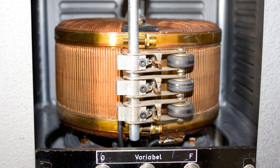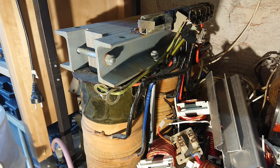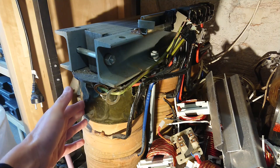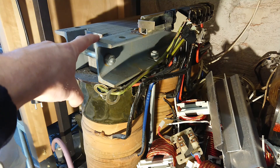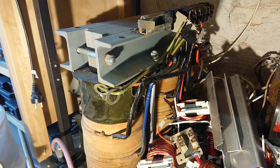Once I get to build some housing for it you'll see that it's enormous. I'm not quite sure if it's even practical to own in order to move around and use with Tesla coils — it's perhaps just too big and bulky. For the 3×13 amp variable transformer that I built into the enclosure with a data monitor, I also got this original three-phase isolation transformer rated for 10 kVA. It's not just an isolation transformer — it also has taps going from 415 volts down to 110, so that's incredible utility at that power level, with taps for four different voltages in that span.